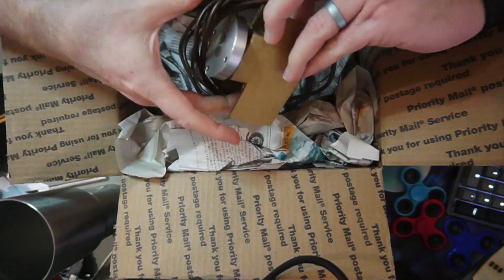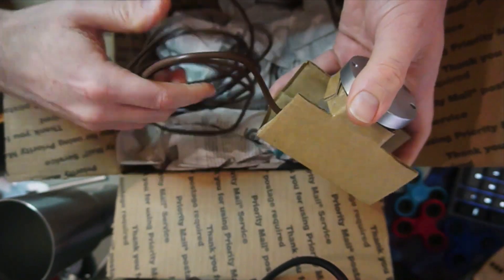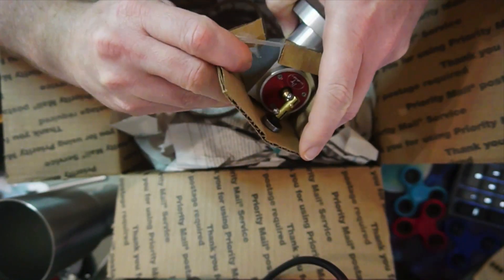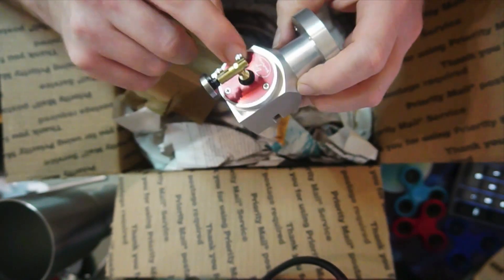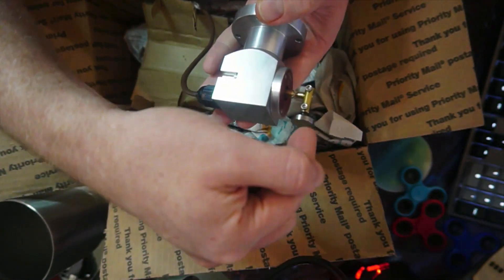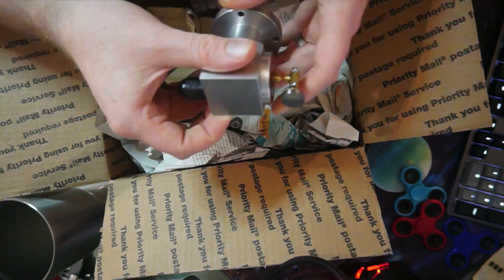I jumped on this and just wanted to do a quick video. I'll put a link in the description. It's a nice one — I'm sure it's based off his wire touch probes that are not super expensive. It's a horizontal housing, and you know what that means: I can come in and get my tool height from touch probing, and I can get my tool diameter. This is going to be a great addition to my machine.